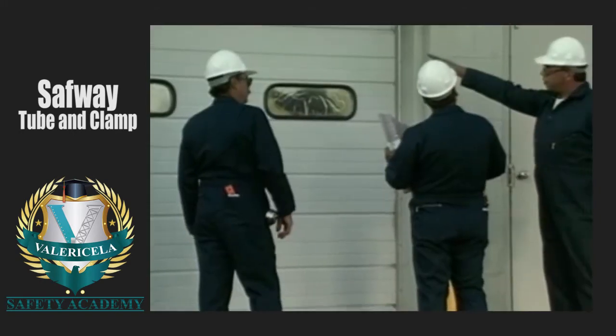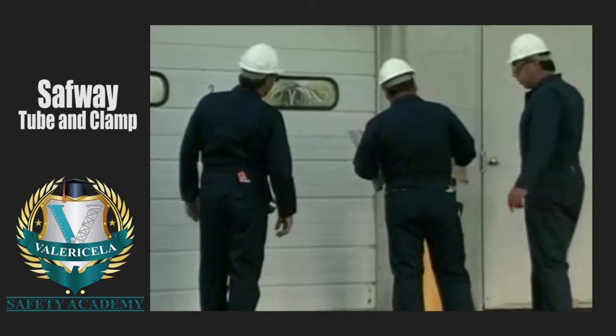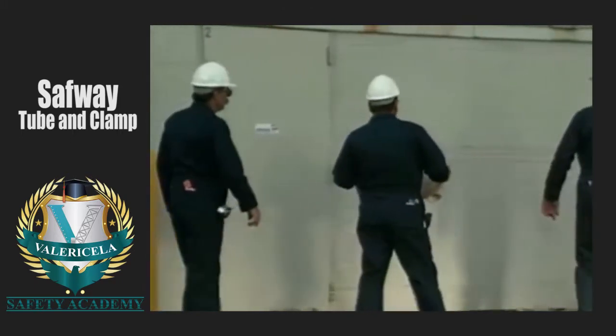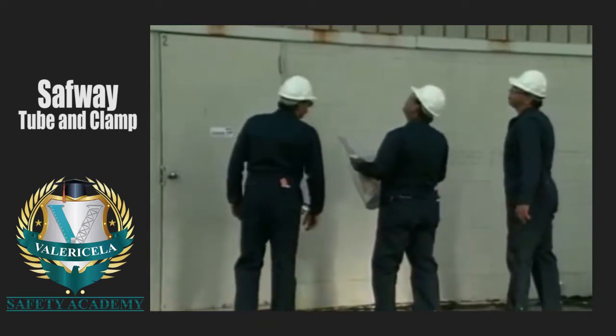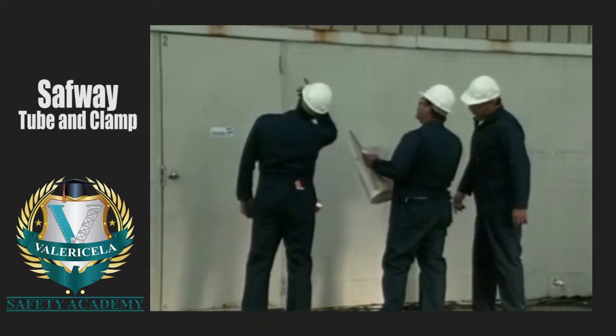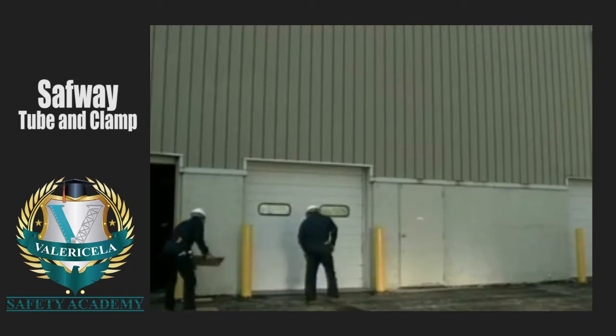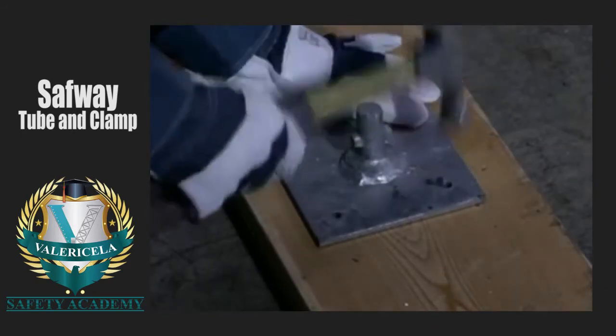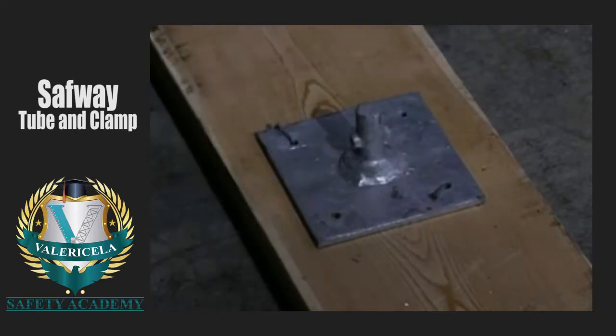Now, refer to the scaffolding plan and mark the positions for the mud sills and lay them out. The sills should be level and in full contact with the supporting surface. Once the sills are in place, position the base plates in the center of them and nail them to the sills. We'll have more in a few moments.